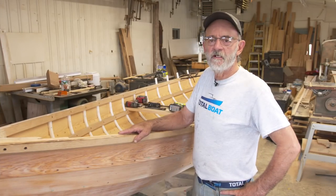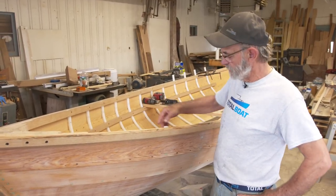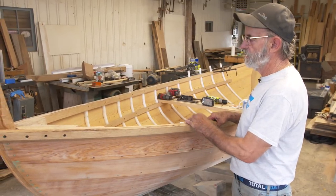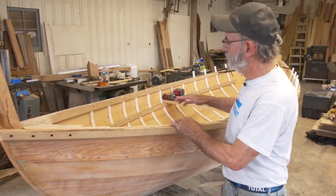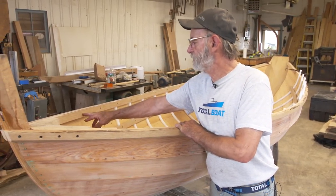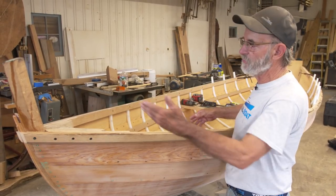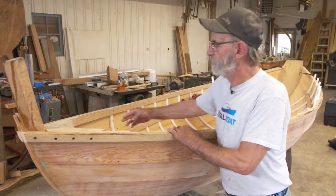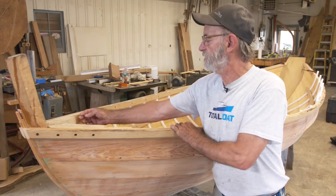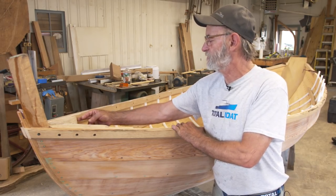We've got the guards on both sides of the boat, fastened right on. We screwed them from the plank into the guards and fastened them down at both ends. We're moving on to the in-wales. I've got one in-wale in place right here. Putting in-wales in is a little bit of a trick because they don't just hang over on both ends and get cut off — you're stuffing them up against the breast hook, and in this situation the in-wale actually goes behind the breast hook, which is kind of interesting.